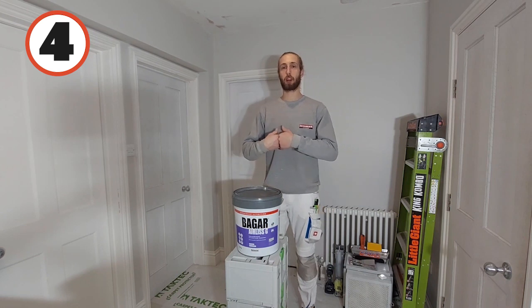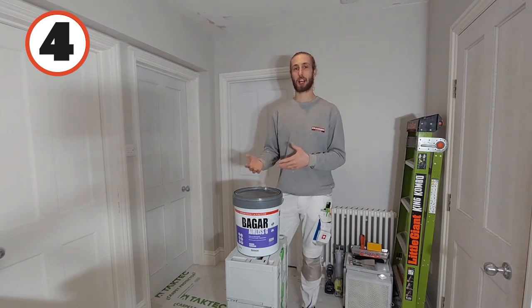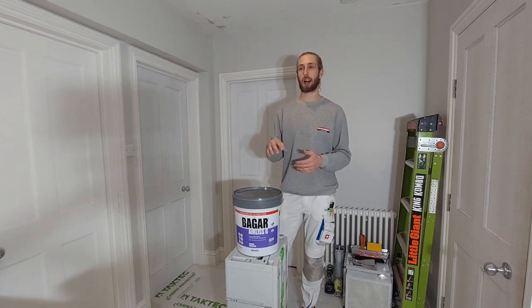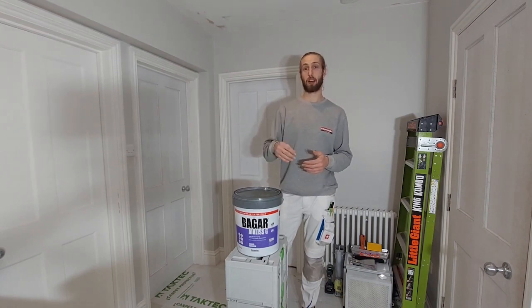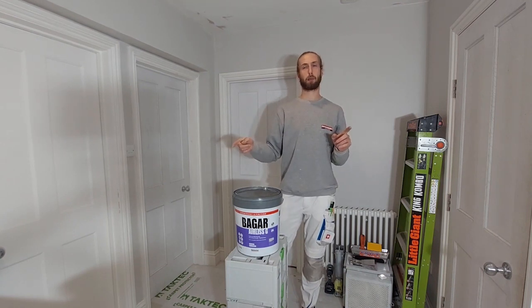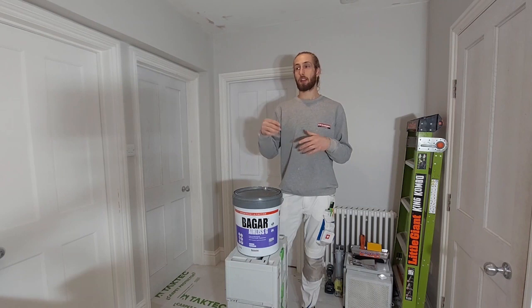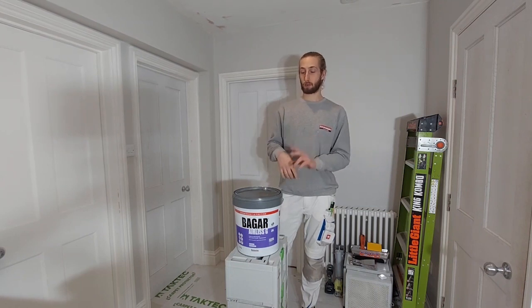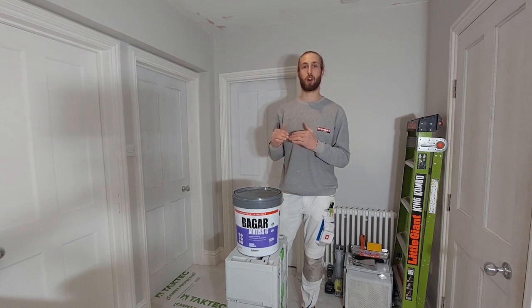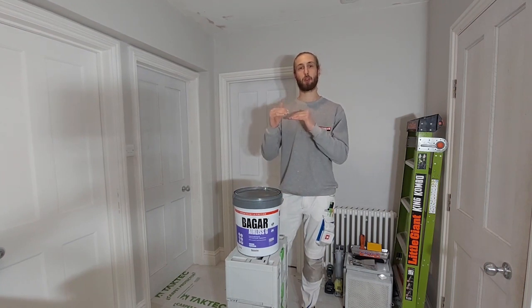So when you're going onto the spray plaster side of things, when you're maybe getting a thicker build on, I was able to get that spray plastered ceiling finished from first coat to final coat in about 3 days. The thickness of the first coat was a lot. I was probably pushing it to its absolute max. It was probably at 5 mil max on the first base coat on the Artex.